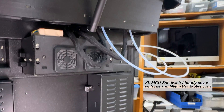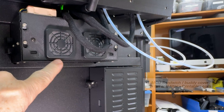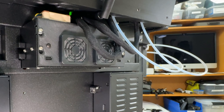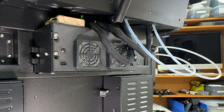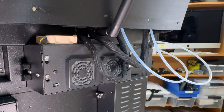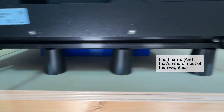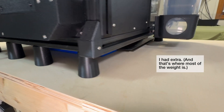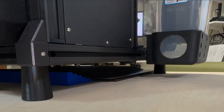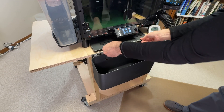I did the buddy board cooling modification — this is the fan up top. I went ahead and gave it two intakes, two openings. When the printer is on, as you can hear, there's a bit of fan noise all the time, but these boards stay cool and I quit worrying about how hot they were getting. The feet on this printer have been extended and I've added extra feet in the back — it's up an extra two inches perhaps from standard, in order for me to install underneath my flex plate holding system.